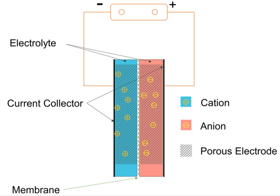A Faradaic pseudocapacitance only occurs together with a static double-layer capacitance, and its magnitude may exceed the value of double-layer capacitance for the same surface area by a factor of 100, depending on the nature and the structure of the electrode, because all the pseudocapacitance reactions take place only with desolvated ions, which are much smaller than solvated ions with their solvating shell. The amount of pseudocapacitance has a linear function within narrow limits determined by the potential-dependent degree of surface coverage